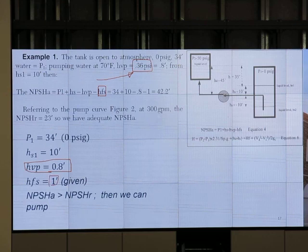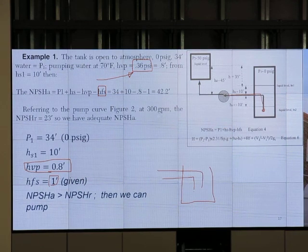This is the friction to go from this point to that point. When liquid comes in from a tank like this, liquid goes in here, and that is a pressure drop already. We call it sudden contraction. When the flow area is large and it instantaneously contracts to a small gap, we have an acceleration pressure loss because of the instantaneous contraction.